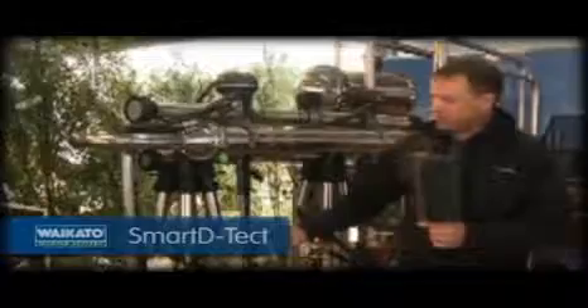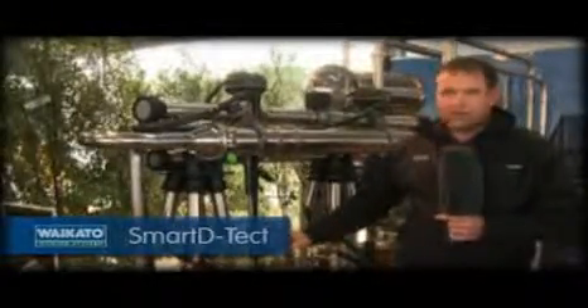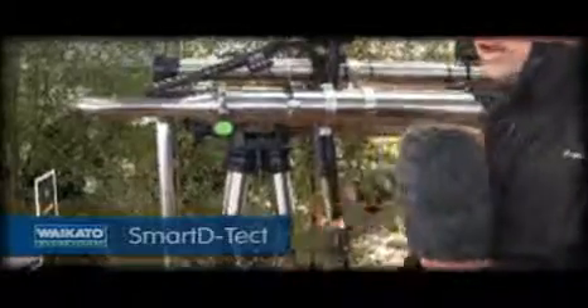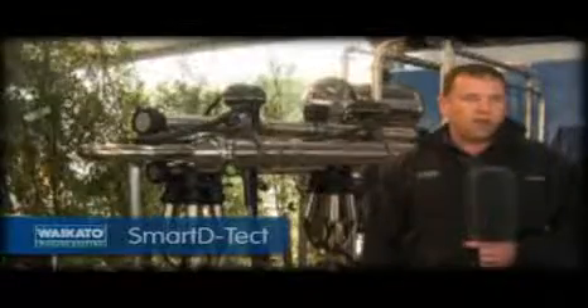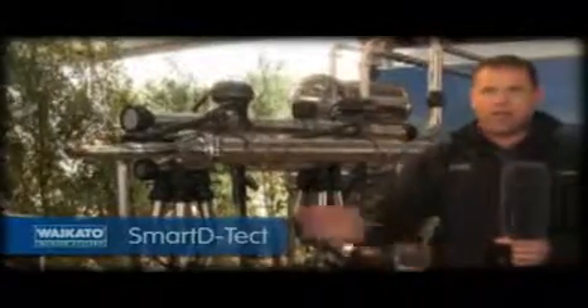So now we're pulsing normally again and the system's doing its analysis. And if I've run this right, it should give us a very fast alarm here in the next couple of moments. There we go — that's the alarm the farmer will see, alerting him that the cow has likely got a mastitis problem. If he doesn't have a herd management system, he addresses it on his own by marking the cow and treating her. Or if it's connected to a herd management system, the alarm signal gets sent through to the database and the cow gets automatically drafted at the end of milking.